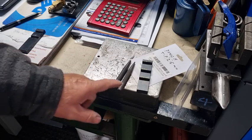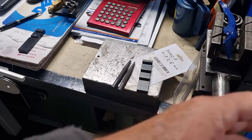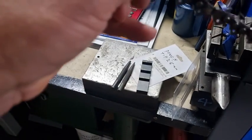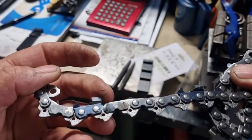If you slip off the punch while holding it like that, you can hit your hand and that can hurt. So there is an easier way still using this system — and I've prepared two examples here — and that is to use an angle grinder or a bench grinder to grind the rivet heads off. As you can see, I've already ground them off.